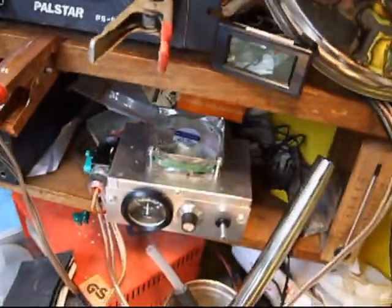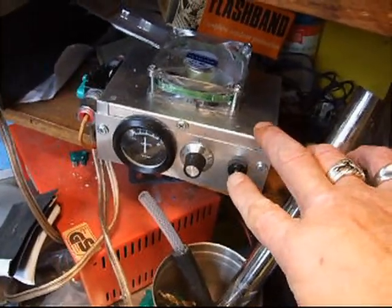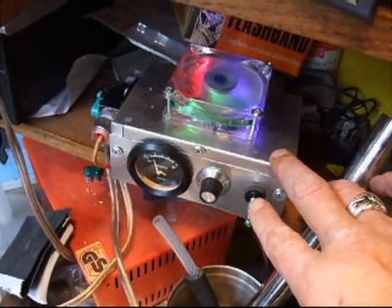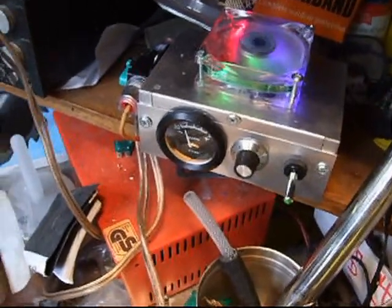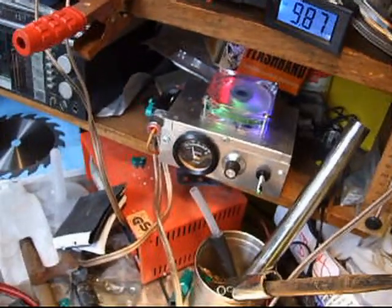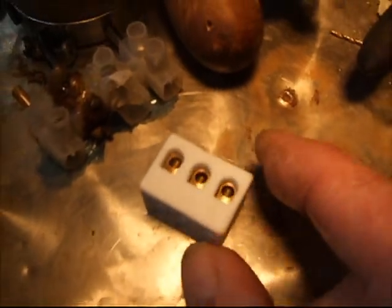Little volt measurer. There's my little groovy pulse width modulator I made — crisp little digital lights on the top. That's about a 30 amp pulse width modulator. Actually, I've just replaced on the back these little power blocks — you can see what's happened, just burnt out, got too hot. Plastic joining blocks — pile of crap, no good for a pulse width modulator. What you need is little ceramic blocks.